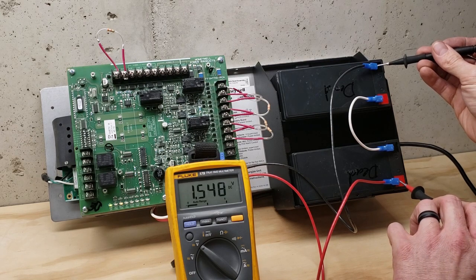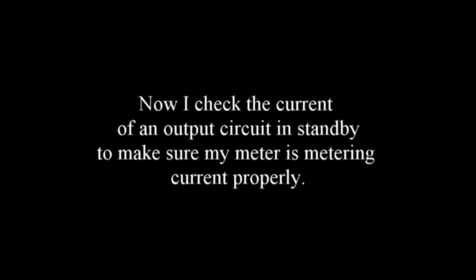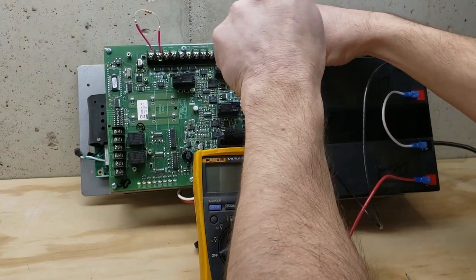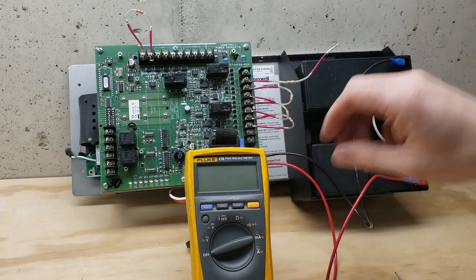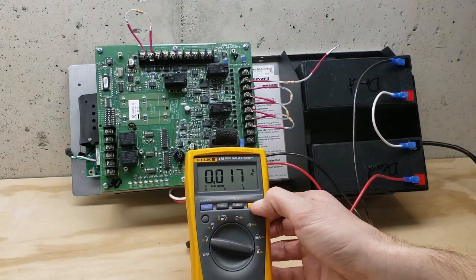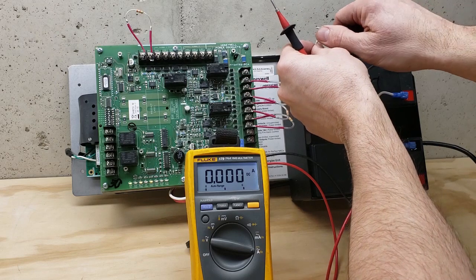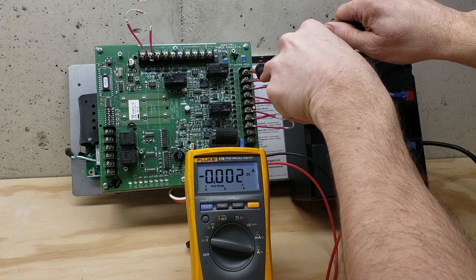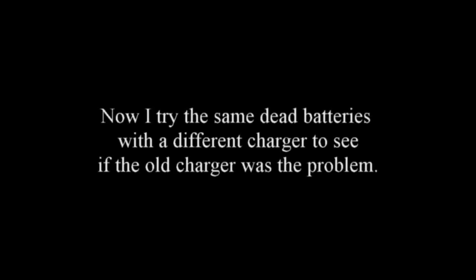The question is: is my charger working or not? First, let me prove there's nothing wrong with my meter — how do I know I didn't blow the fuse? I'm disconnecting the output circuit, which would be like a horn strobe or strobe circuit, and metering the standby current. It should be very low but I should see something if the meter is working properly. It's set to DC current, and I have two milliamps — which is tiny, but it should be tiny. My meter is working.